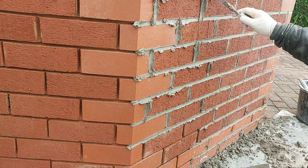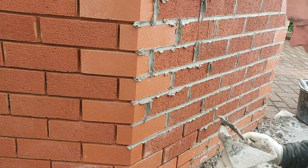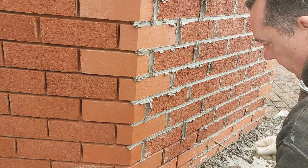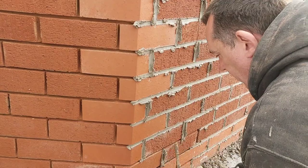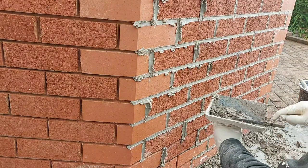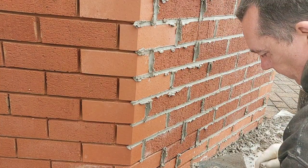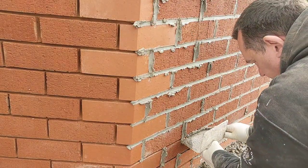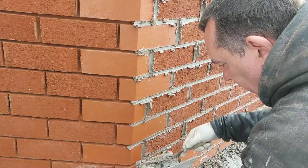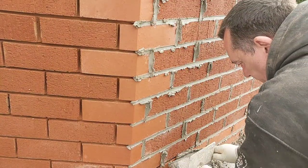And then if you come to pull these off, you can mark the wall — see, that's too soft, it never popped off, so just weave it. If you get near the bottom and your trowel won't fit in, just turn your trowel over, pick it up from the other side and come up. When it's deep like this, you can only do short bursts. You see people do a big long line, but they've just not ground it out deep enough.